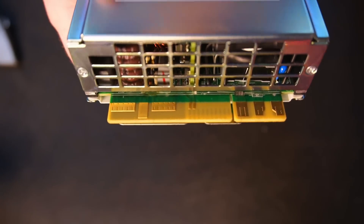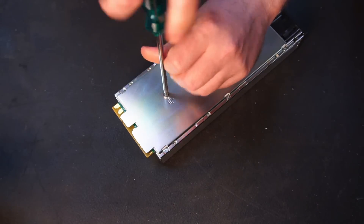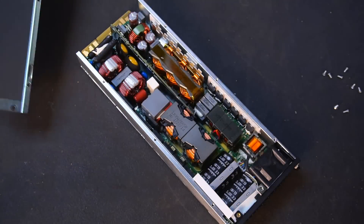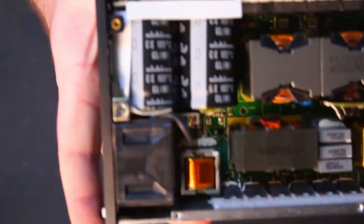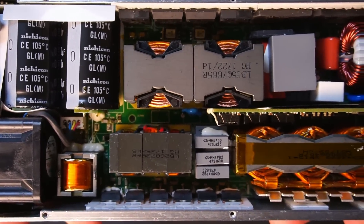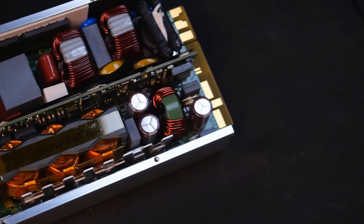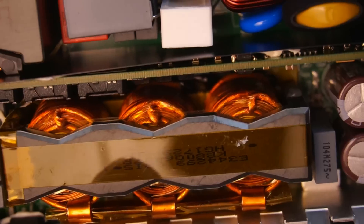The first thing on the to-do list is to remove two metal tabs that partially cover the underside of the PCB. First, remove the top cover. With the top cover removed, let's take a quick look inside the PSU. Since this is a commercial product designed to be operated 24/7, I expected to see high quality components, and I'm not disappointed. They have used top quality brands such as Nichicon and Chemicon. You'll also see a few temperature probes here and there, so I'd imagine this PSU has quite a few safety features you wouldn't find in your average PSU.